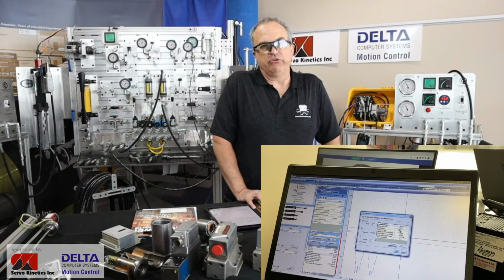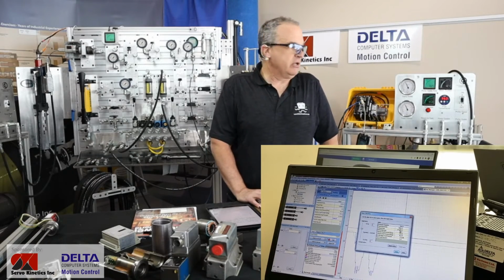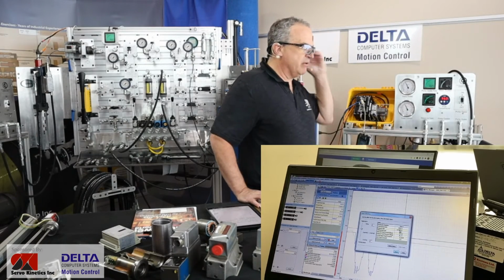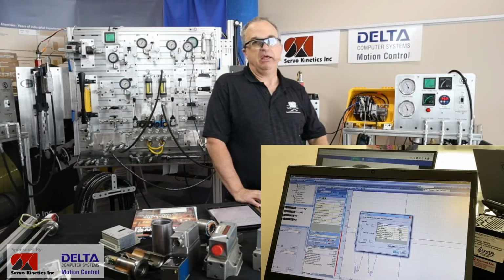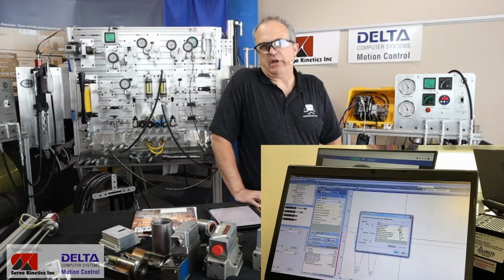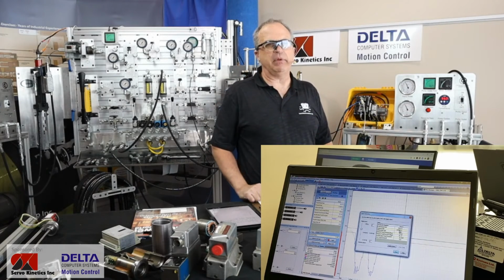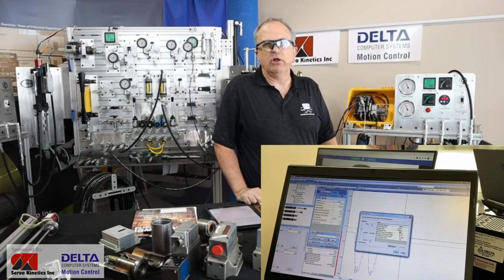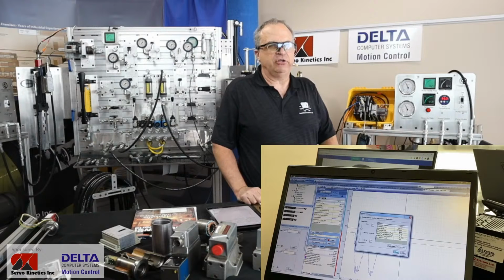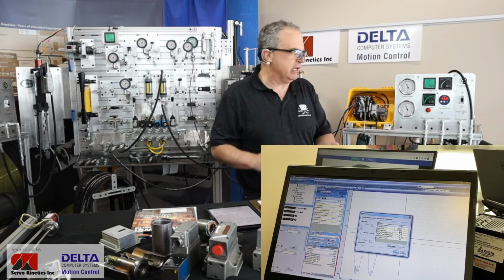And if that error was fairly large, however large it was, the proportional gain calculation is made. Whereas the integral gain is calculated off of the persisting amount of error, because proportional never finishes. It's always proportional. It leaves you with some error. And integral says, how long does that error persist? I'll continue to give a corrective action to try and finish up closing in on the target. So that's a second calculation.